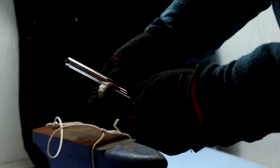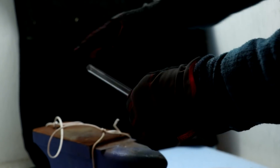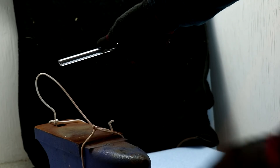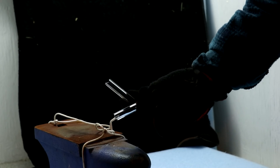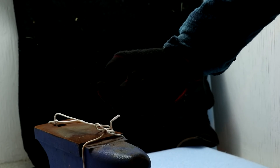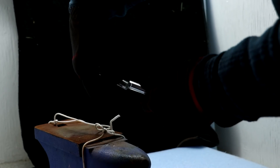But now, if I disrupt the glass a little bit by introducing a defect — give it a little bit of a scratch from this piece of barrel here. Now, if I take that scratch and put the string on the scratch, the anvil is able to be picked up just fine. Now, if I turn the glass over so the scratch is underneath, on the side facing down, away from the string, the glass snaps in half before the anvil moves. What happened is the tensile strength was greatly reduced because I introduced a bunch of tiny micro cracks into the glass. As long as I'm compressing those cracks, the glass is fine, as the cracks are being held closed. But if I turn it around, now the cracks are wanting to open up, and they propagate, and the glass breaks in half.